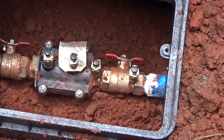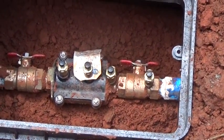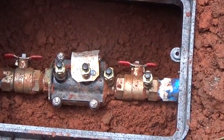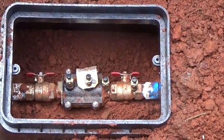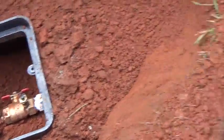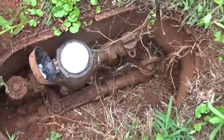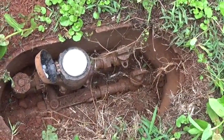It's required for fire code. So if you ever want to tie in a non-potable system — maybe you put a well in for irrigation but want to use it as backup water in a house — this is what you're going to be required to do: put in backflow prevention. Make sure you check with your city, county, or whoever controls your water and get their take on how to do this correctly so it will not feed back on everybody else's system. There was another check valve in this system, so there are like three check valves total, but you still have to put that separate backflow preventer in.